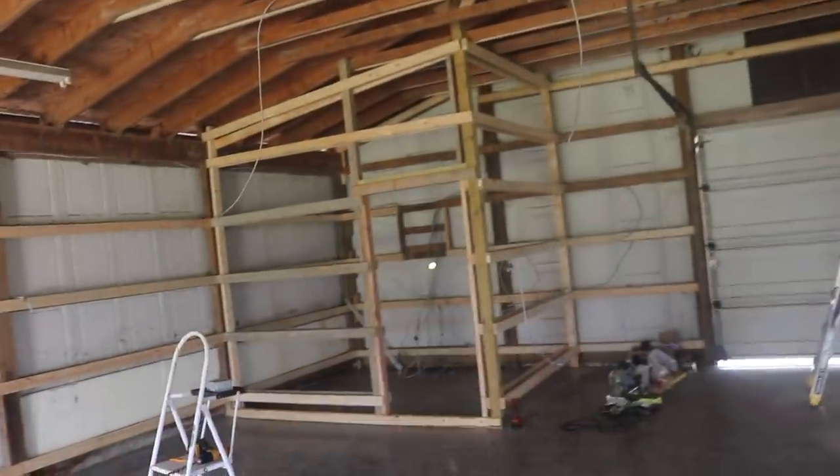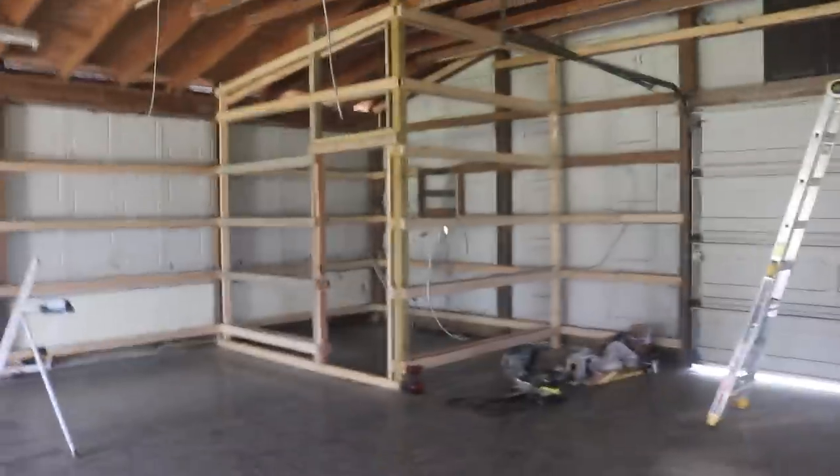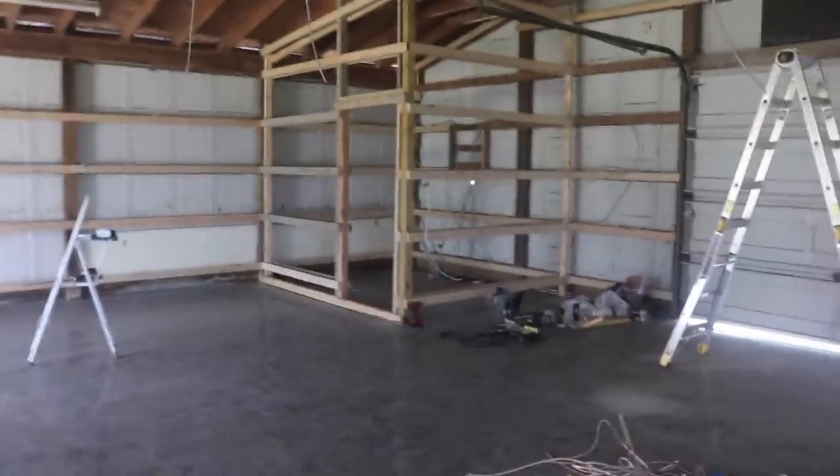A few days have gone by since Ty was here and we were finishing up some work. I'm pretty pumped at the progress we've got on this shop. In the corner here we have a corner office going in — obviously far from done — but we did get some of the wiring prep done. We ran all new wiring through this entire barn for all the lighting, all the outlets, all the switches. There's a three-way switch over there, we got a 220 ran for a welder — a whole bunch of stuff.